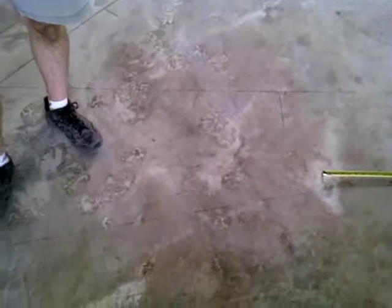Yeah, absolutely. Okay, so you're all right with me moving this wall? Absolutely. As long as we can stick the gypboard in there still, 6 layers, I'm good. Well, it just stacks this way. Right. We're going to put 6 layers here? 3 on each side. Okay. It shows 2 on that. Yeah, we made some changes just to this wall because it's so integral. That zero sound gets through. I didn't remember if it went on this one. I knew that when you were talking about tripling, each gets 3.